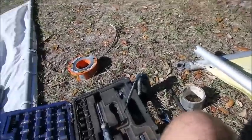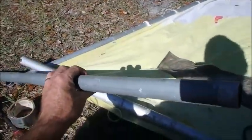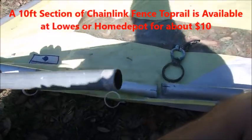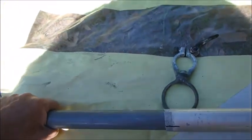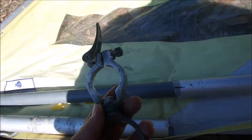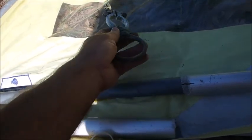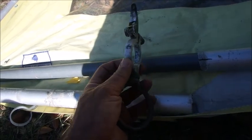To fix this on a budget: a piece of chain-link fence galvanized top rail is almost the same size as the inner diameter of the Sunfish boom. It will slide right inside the original boom itself. Using the inner diameter, we can locate our original hardware for the mast close to the spot that was originally damaged, whereas with an outside collar you can only slide your mast boom up to the edge of the collar.